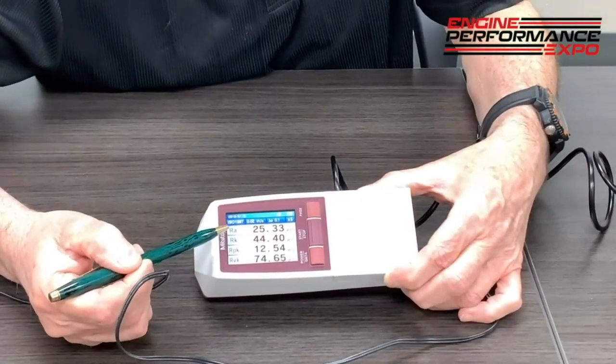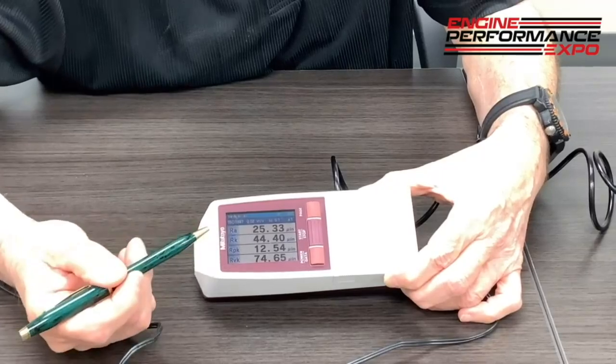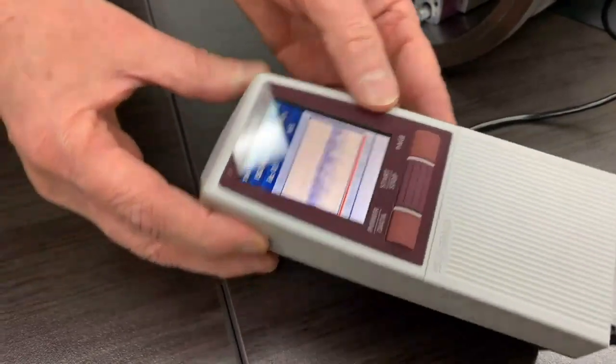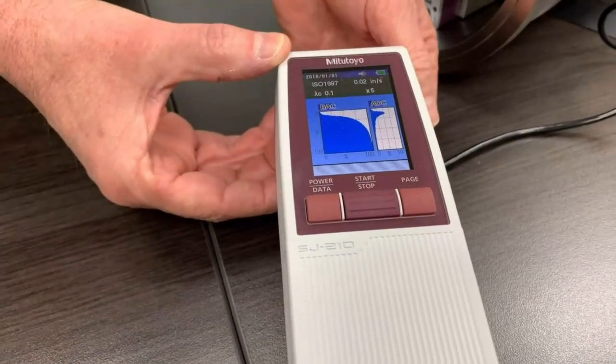This is really pretty decent, especially for a replacement or factory-type cylinder — decent peak number, great valley number, good core number. That's some basic use of the profilometer and the holding tool. Hopefully that helps. That's the basic walkthrough of the Mitutoyo SJ210 on reading, setting up, and calibrating. As always, if you have any questions — because this is just measuring the work, but how do you get the finishes? We've worked diligently with our customers, especially with the good folks at Rottler. We can help you figure out how to get to where you need to be with these numbers. Feel free to reach out to us. Have a great day.